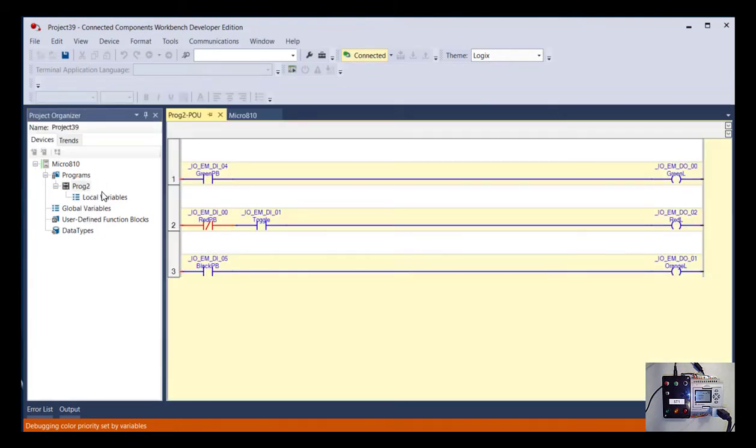it's opening the window, and this is the ladder diagram for the logic that's running in the PLC. And as you can see, it looks very similar to what we just drew out on paper in its layout and in style of information. So on this first rung, we call a rung the horizontal lines there, we have a normally open contact. It looks like a normally open relay contact. It can be any contact, anything could be hooked up to that. It could be a push button, a limit switch, a float switch.